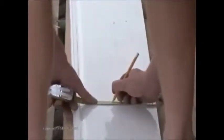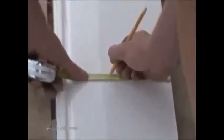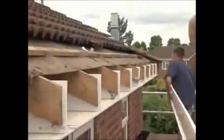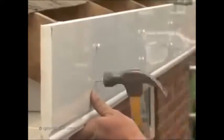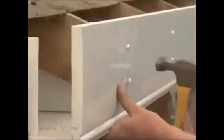With the protective film in place, the fascia board is marked with two parallel lines that show where the two 65 mm plastic headed nails or screws will go at each rafter foot. This means that when the fascia is fitted to the rafter feet, the run of nail or screw heads will present in a neat line. The nails are only partially inserted in order to allow the film to be removed. Afterwards they are driven fully home.